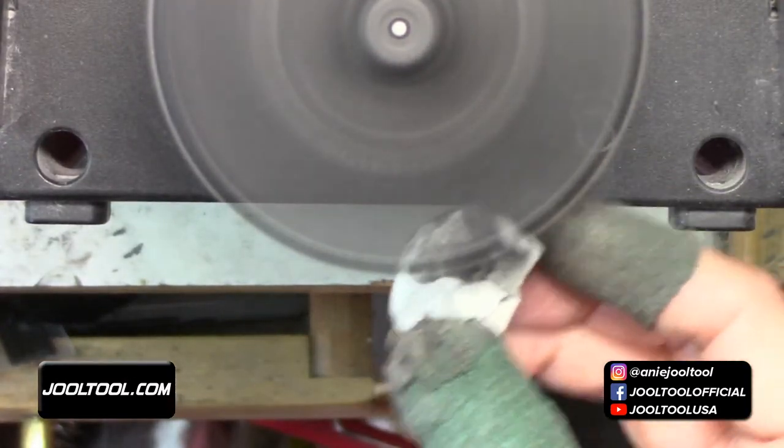Yes, so you guys, wait, hold on. Let me just ask. Are you guys clear on how to fix the stainless steel spoon that got caught in the garbage disposal? Just like you saw me do, I clean the edge, and use your scratch eraser to smooth. Then if it's a matte piece of silverware, leave it, or hit it with a 220 grit brush finish to restore and match the finish. Or if it's polished, of course, take it to the felt and polish it. My compound will polish stainless steel. But yeah, that's all you really need to do.